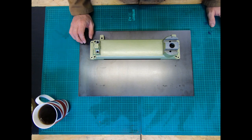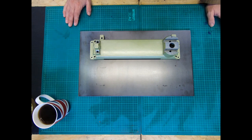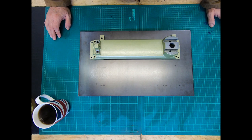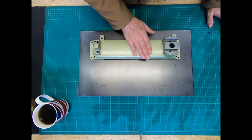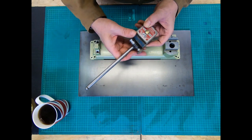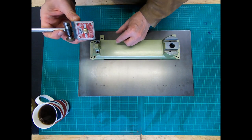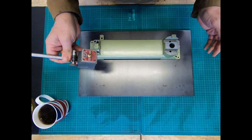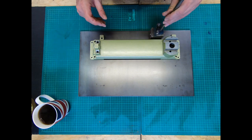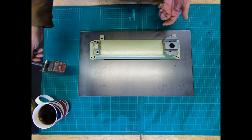One of the reasons I've gone for a metal base rather than a wooden one comes down to seeing Robert on the Xanadu channel. He has a nice little playlist where he restored a small Schaublin lathe, and one of the things he did was put it onto a wooden base. One problem he had was he couldn't use a magnetic dial holder, so he added a strip of metal to allow that. I've just gone straight for metal, so when I switch the magnet on it can fit anywhere around the lathe to do whatever I need.